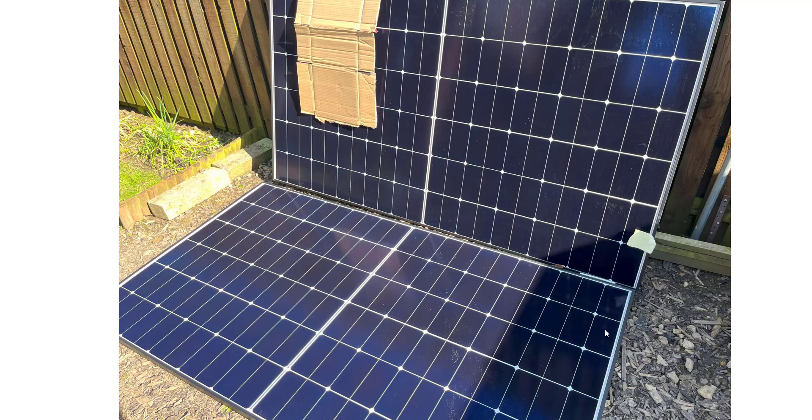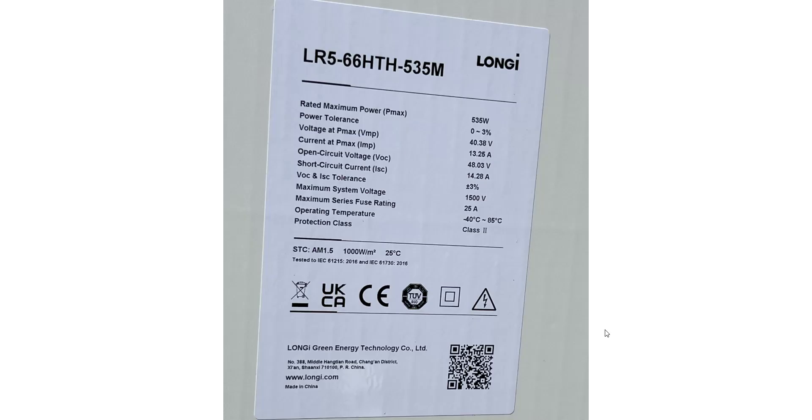Because the surface of our shed is black there won't be much reflection, so I see no point in using bifacial panels. I'd rather have the extra real estate of two meters of cells facing the sun directly, giving an additional 100 watts of power, which more than compensates. The panels weigh around 28 to 30 kilograms so you'll definitely need a helper when installing them. They come with 3.2mm coated tempered glass, an anodized aluminium black alloy frame, a 15-year warranty for materials and processing, and a 25-year warranty for power output. The maximum power is 535 watts — almost 100 watts more than commercial roof panels.